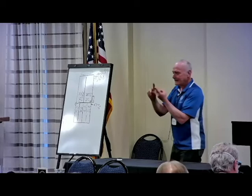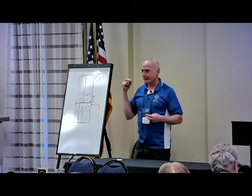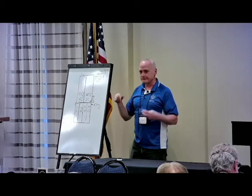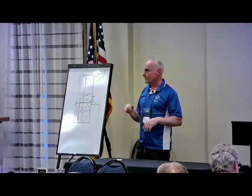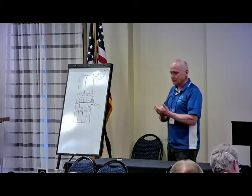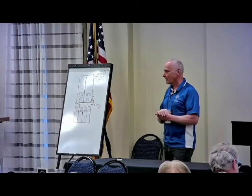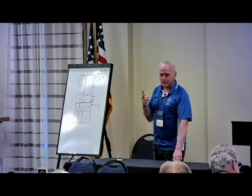The second one is steady foam. As we boil, these pans are going to start to foam. Now, the good Italian chefs, when they cook pasta noodles, they use a little olive oil to break the surface tension of the bubbles, so when they cook the pasta, it doesn't foam over the top. Well, we do the same thing, but we don't use olive oil. What I will suggest for you to use is the Atmos 300. If you're not certified organic, it takes the least bit of that material to keep your pans defoamed, and it's a non-allergenic product. If you're certified organic, there's two products that I would recommend.